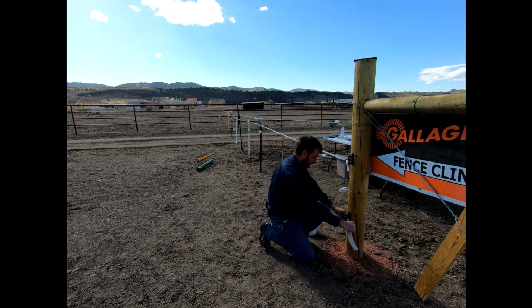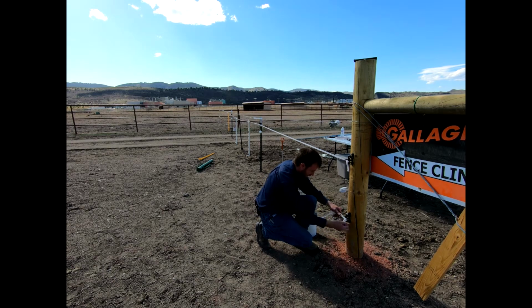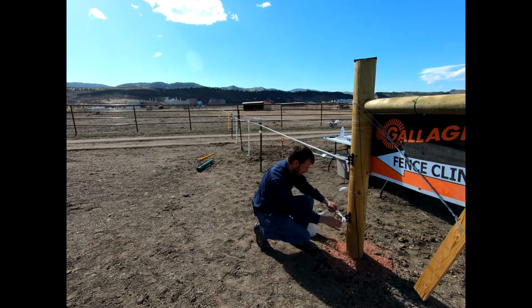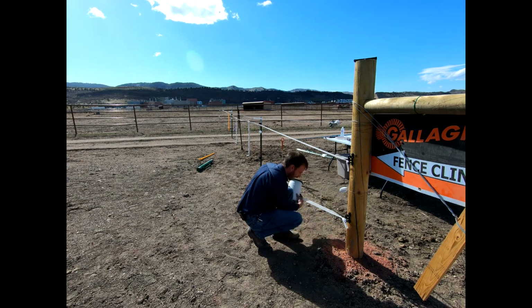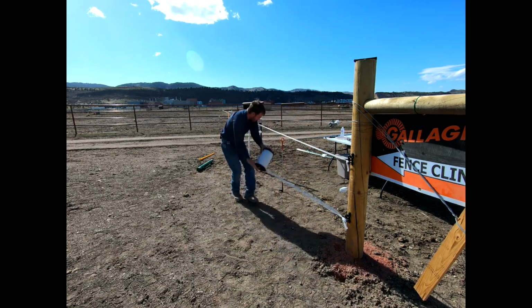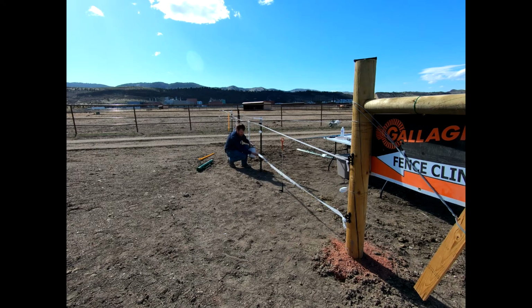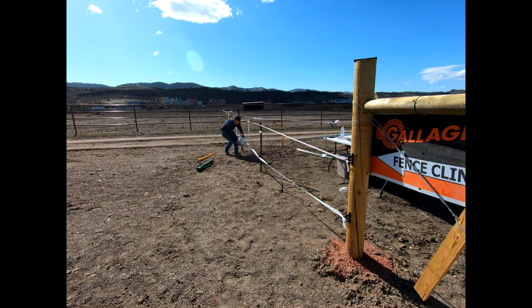And so let's take our 1.5-inch tape. We're going to put this in here again just for ease today. I'll show you some other termination ways. We will attach this here, snap that on. Again, as long as it's not touching a post, it's not grounding out anywhere, let's go ahead and run this all the way down our entire fence, and we will attach it in various sections to our T-post clips. And so here we'll undo our T-post clip, snap it back in, run it past our plastic posts. We will run it inside those.